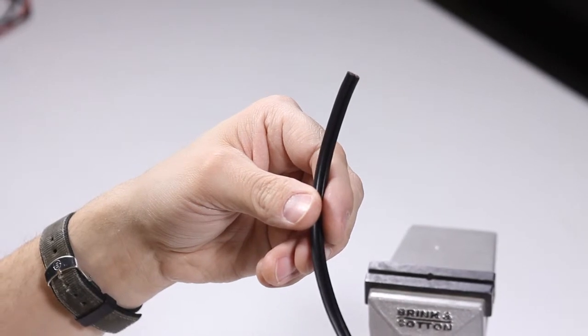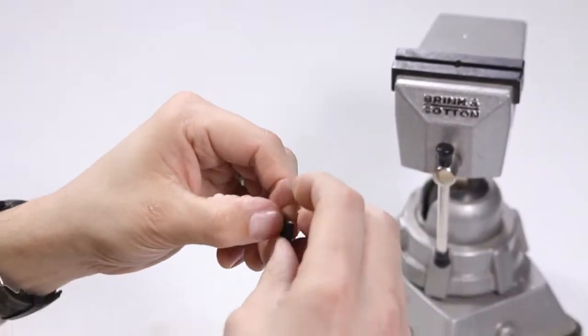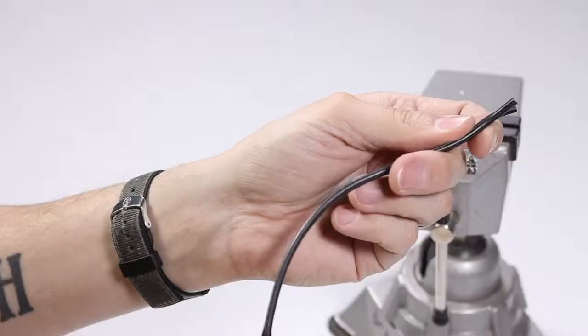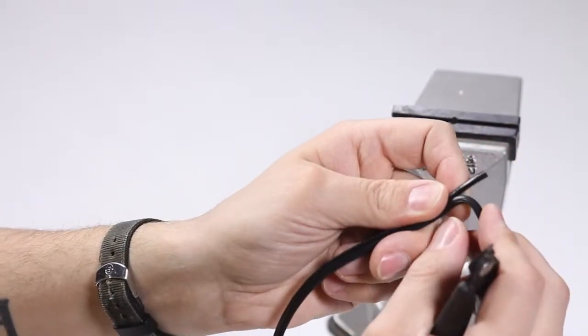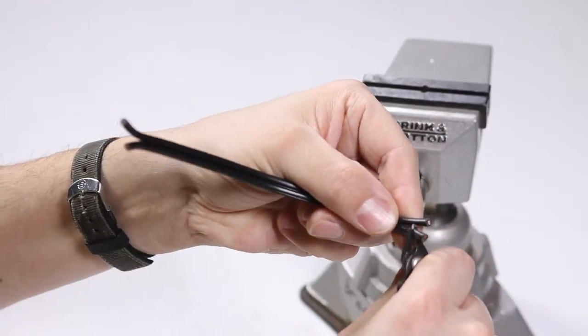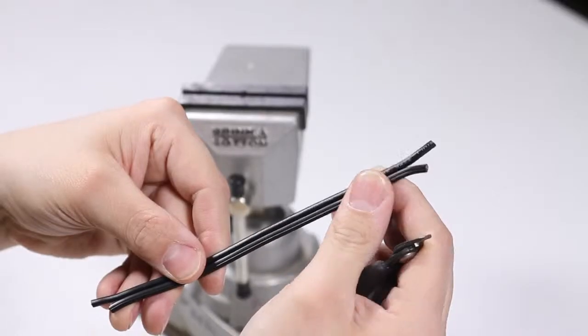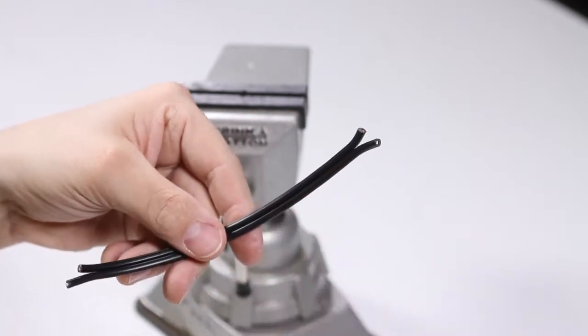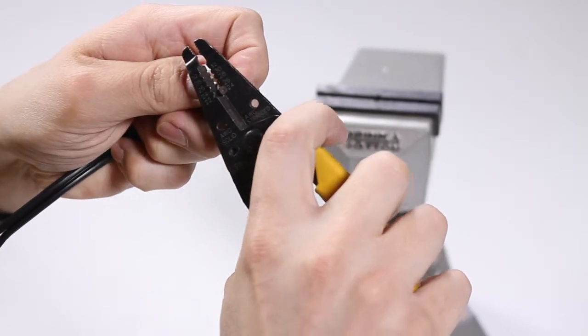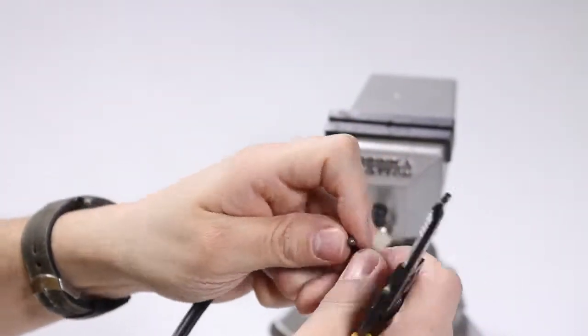We are going to be assembling the speaker cable for the 1x8 cabinet. First thing to do is take your 6-inch zip wire and separate the ends by about 1/2 inch, just like you see here, and then take the ribbed wire, not the writing wire, but the ribbed wire, and clip off about 1/4 inch of that off each side, so the ribbed wire is shorter than the smooth wire. And then we're going to strip all 4 ends of that zip cable.